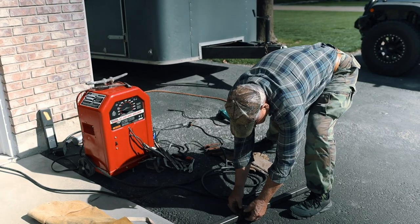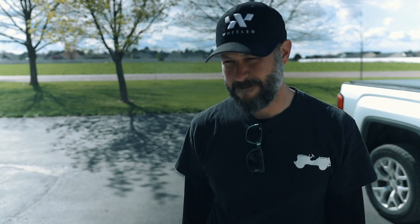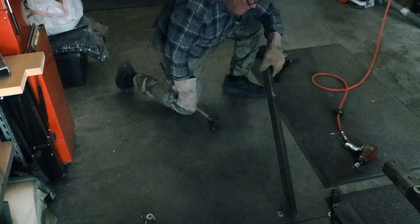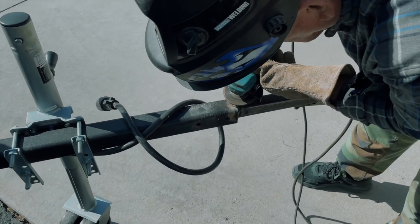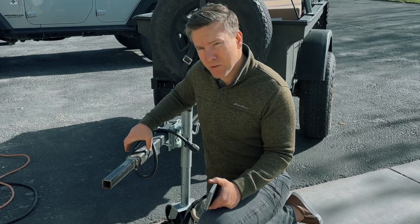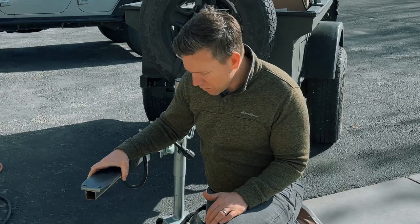We grabbed the metal tubing and the washers, and my dad cranked up his arc stick welder and started melting metal. Here's my dad getting ready to weld, and here's Chris drinking whiskey — supervising. My dad made quick work of welding the four washers to the tube. We took it back inside and with the washers attached to the sides it was a much tighter, centered fit. With step one done, we welded the two tubes together heavily, ground everything down, and were ready to attach the mounting plate.